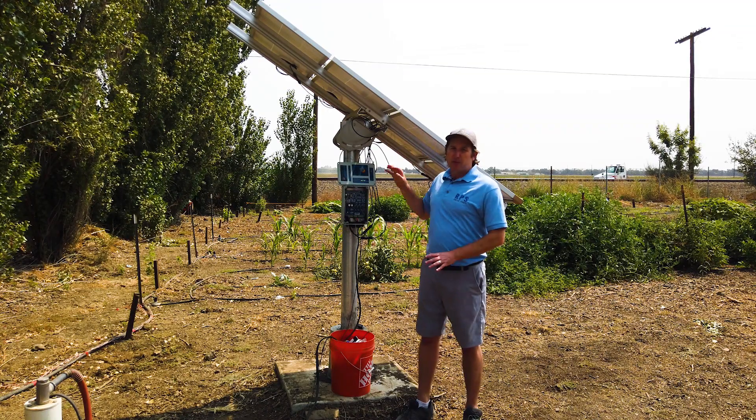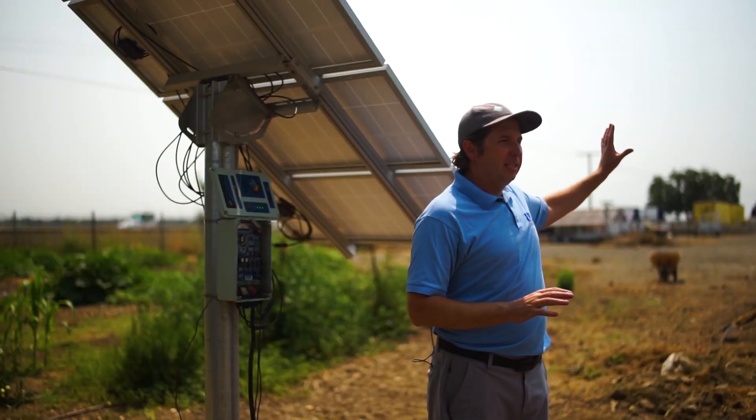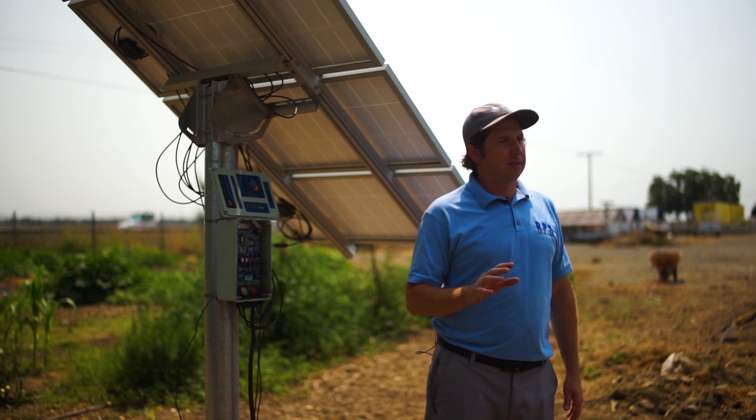If your speed dial is on 10, then we're going to want to go look at our solar panels. We want to make sure they're in nice full sun and we're testing on a clear day where we're getting maximum energy production. If you set up your system throughout the day and it's four or five o'clock in the evening when you're starting to test it out, there might not be enough sun to run it, so you may have to come back the next day to do your flow rate testing and troubleshoot the system.